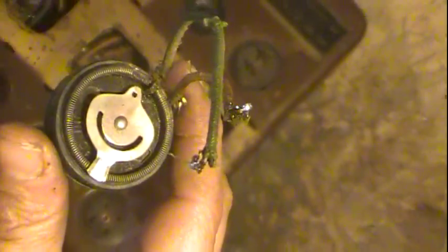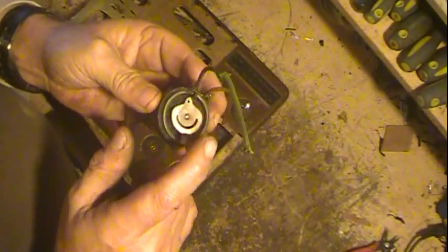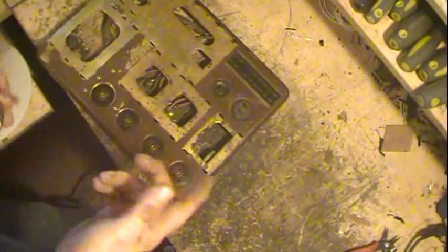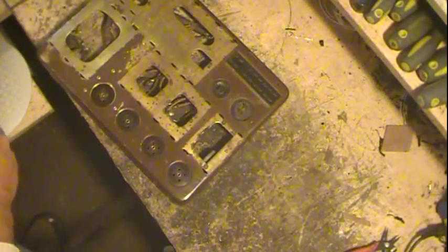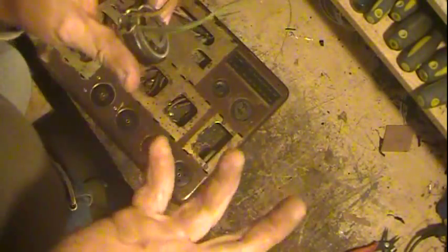That's a potentiometer. This has only two connections, here and here, and one's going to the wiper, one goes just to one end of the winding. You notice here the winding does not go all the way to here. This is a rheostat, or variable resistor. I could back this thing out, I forgot it zoomed in. But that's what these actually are, rheostats, whereas the others are potentiometers, so I just wanted to point that out. I hear them used interchangeably, but you can use a potentiometer as a rheostat. You just have a third leg here that you wouldn't hook up.